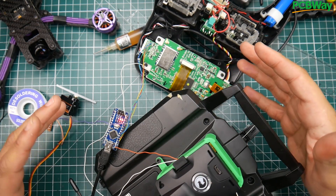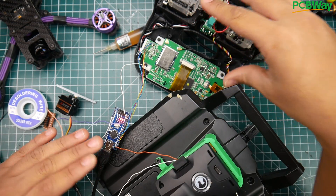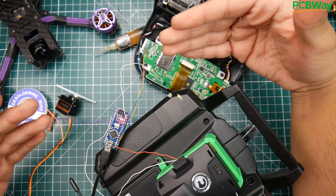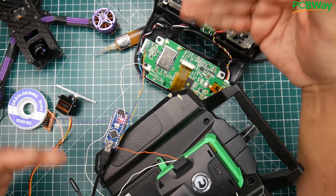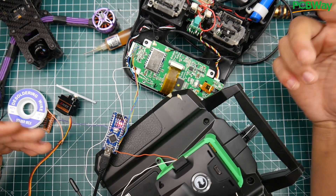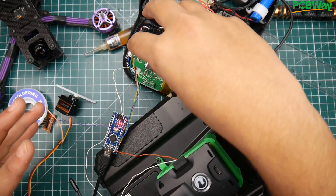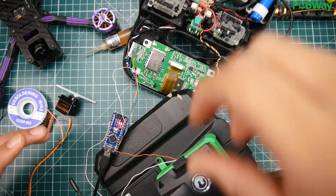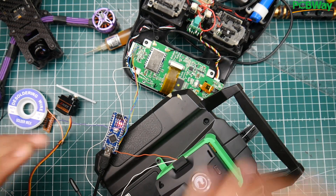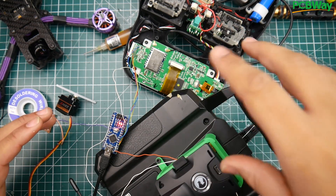What's left is mapping all the channels and making calibration easy. The board runs on 3.3 volts but this input needs 5 volts, so the potentiometers max out at about 3.1 volts — I confirmed this through my oscilloscope. I need a simple calibration method, and I need to finalize the wiring design. I can't use an ATtiny because it doesn't have enough pins, so I'll need a mini Arduino or possibly design a custom board.